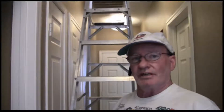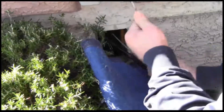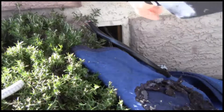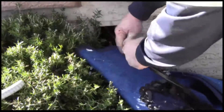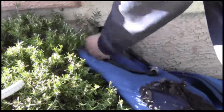We're going to be using the attic access to run the wire. The next thing we do is run the fish tape through the attic and drop it down to the cable TV box just below the panel. We then connect the 6-3 Romex to the fish tape and pull the wire through the attic to the attic access. You need to pull enough wire to reach the outside wall with enough left over to run down the wall and into the weatherproof junction box.